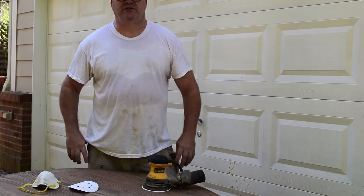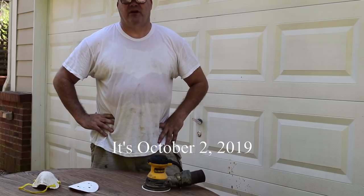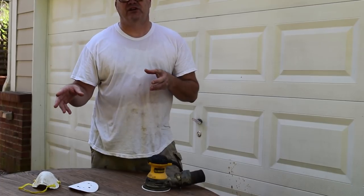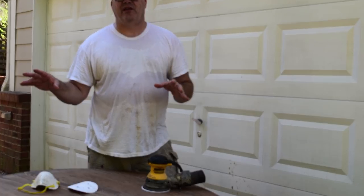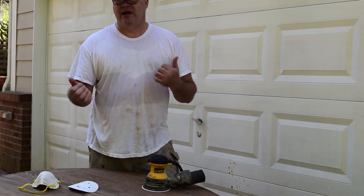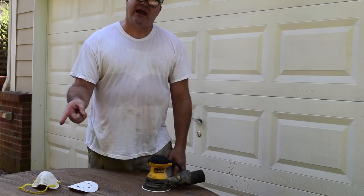Normally the temperature starts to break towards the end of August and we cool down. It's going to be 97 degrees today. That kind of weather affects lacquer finishes. So what we're going to do is get this sanded off outside, get it blown off outside and brought back in. And then whether or not we shoot sealer today, it's going to depend a lot on the weather. But let me get cracking here with the sanding.